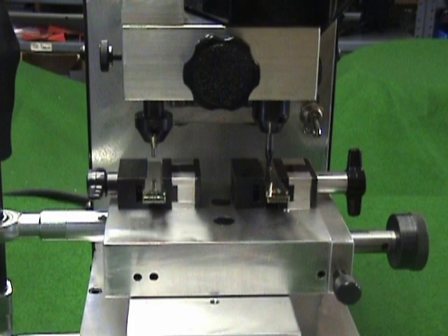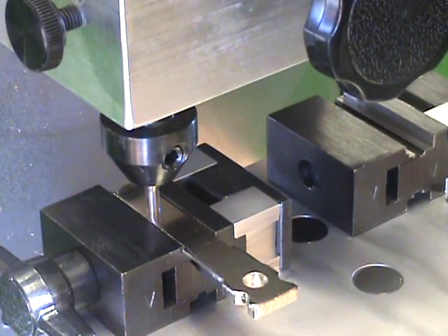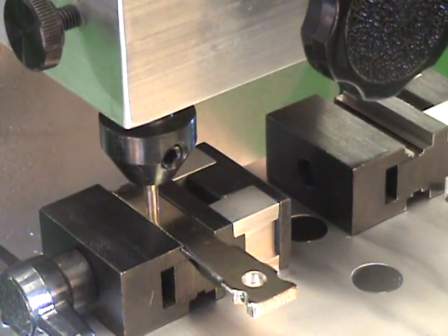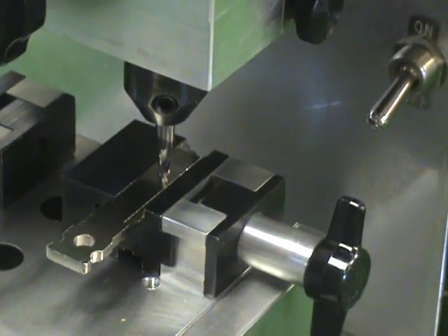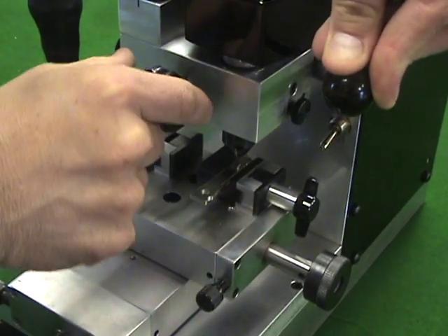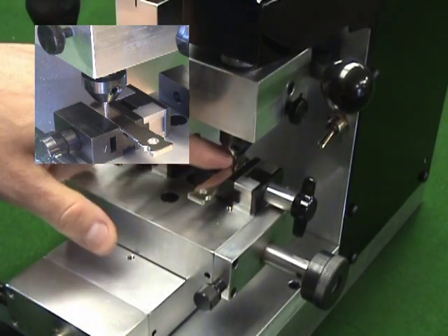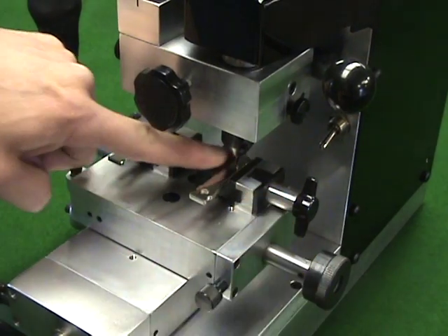Allow the cutter to drop down onto the surface of the key blank. Pull down on the spindle lever until the guide is completely compressed — there should be no up-down movement to the guide if it is fully compressed. While the guide is being compressed, you should be able to see the cutter being pushed up into its collet. With the spindle lever pulled down completely, tighten the cutter head clamp nut to hold the assembly in the lowered position. Check the guide once again to make sure there is no up-down travel, then tighten the cutter with a 1/8 inch Allen wrench. The cutter and guide are now calibrated properly to each other.